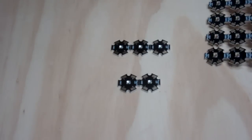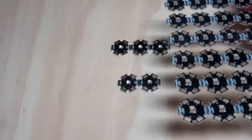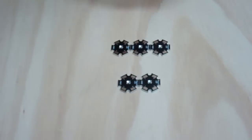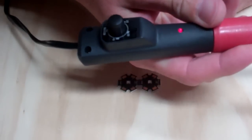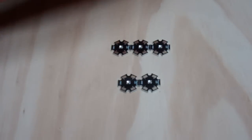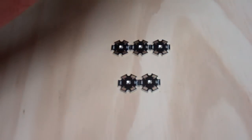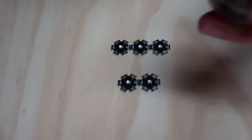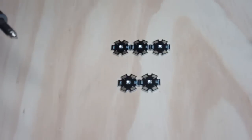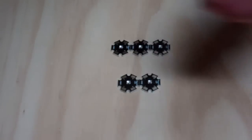What I'm going to show you right here is how to pre-tin LEDs. I've got a whole stack of these — the new Philips 660 nanometer reds from Rapid, and these are the Cree 455s. I'm using a Radio Shack soldering iron that goes up to 50 watts, set at 40. The tip is kind of yellowish, so you take a wet sponge and wipe off the residue. Then you get your rosin core solder — this is .032 diameter 60-40 rosin core from Radio Shack.